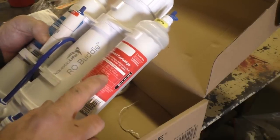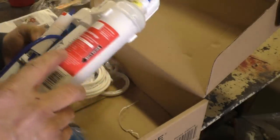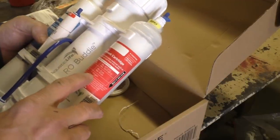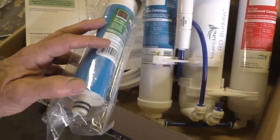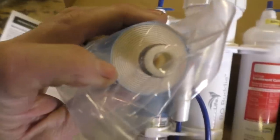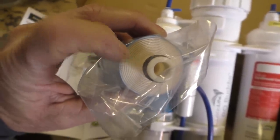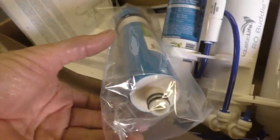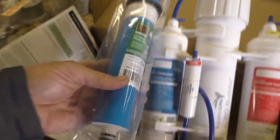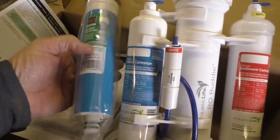So our water pressure is okay, but we're a lot colder right now than what this thing likes. And the flow rate, wow, it's only a half gallon per minute. Now it is a cross flow membrane, just like the membranes we use in the boat. In the end you can see that spiral wound material there, that is the membrane. So water goes in there, and what passes between the sheets that's wrapped up comes out the end here. So you flow a half gallon a minute through the thing, but you get a whole lot less water out.